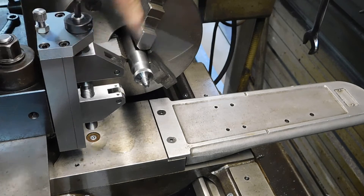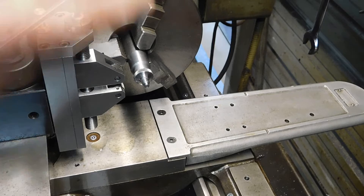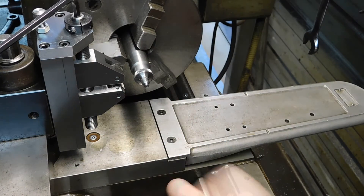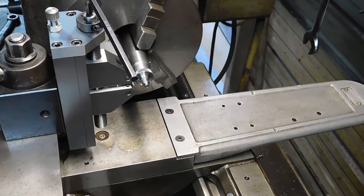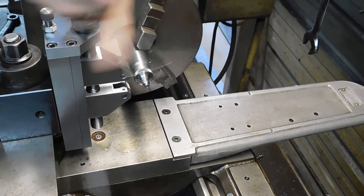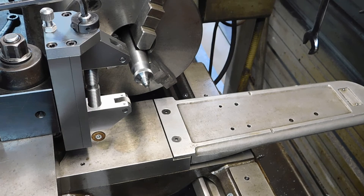This will really save my lathe's cross feed and screw, and that was the idea of the design. This will knurl up to two inches in diameter, and that's normally bigger than anything I ever do. I make little knobs and things like this for knurling. But if it gets over two inches, then you can just bring these together a little bit and just come in and pressure knurl like you did with the other similar knurling tools if it's over two inches. So that's one advantage — I can still use just a pressure knurl if I have to. And there you have it guys, my knurling tool. Thanks for watching.